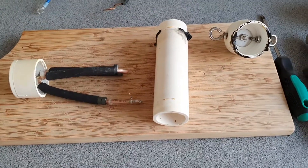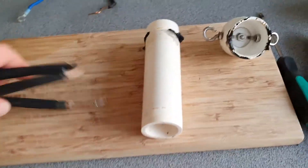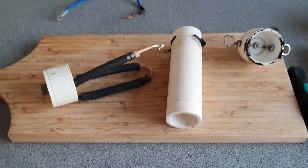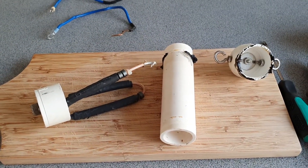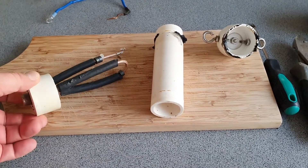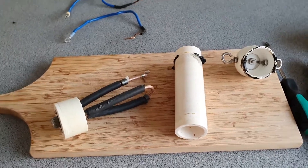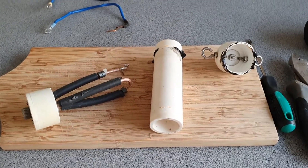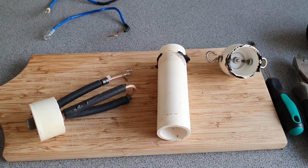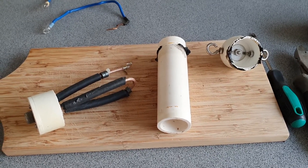We're back at the choke. I'm going to put this back together and re-solder the joints. I'm very happy with what I've finally found out here. I actually did a silly thing and trusted that this was a 1:1 balun, and it shows that out of investigation you come up with answers.